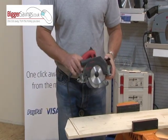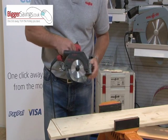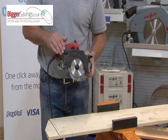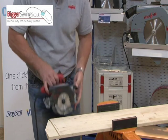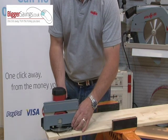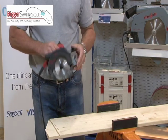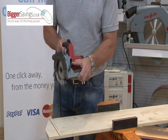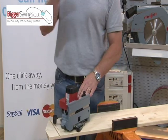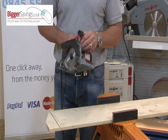You'll see from the saw that it's flush to the right-hand side of the blade — there is no base plate sticking out, no handle to flip your guard back, as that's on top of the saw, and your extraction port is in line. This means you can get right up against your skirting boards. You can even lay the saw flat and trim the bottom off an internal door. If you're laying laminate flooring, you can set your depth of cut to the thickness of your skirting boards, lock it off, plunge it into your skirting boards, run it around the floor, and take a strip of 13mm out so your laminate floor will slide under — no need to take all your skirting boards off.